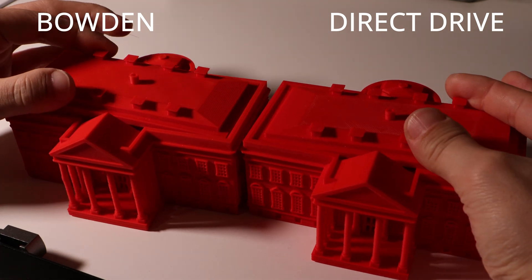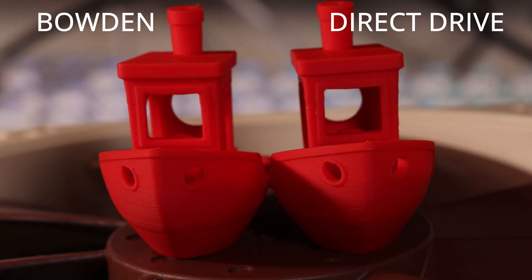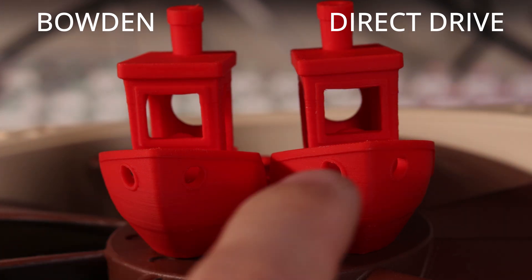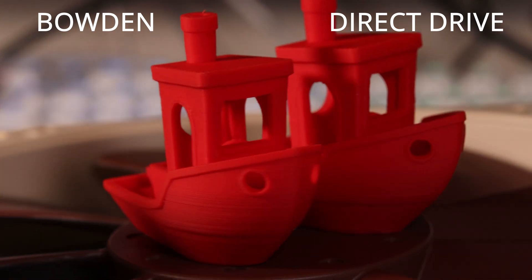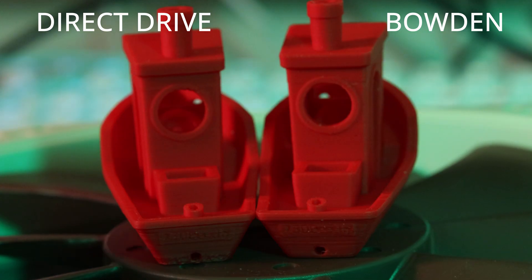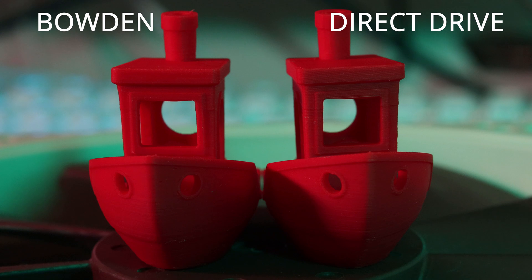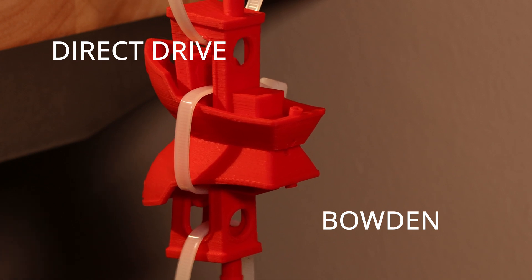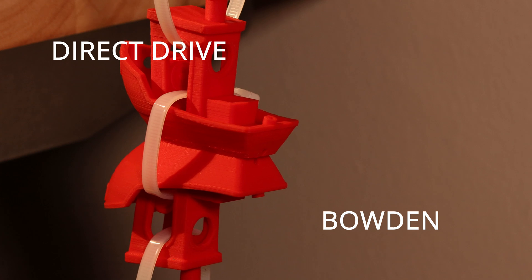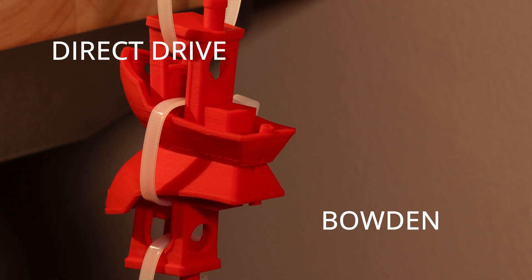When we look inside the White House models, that's where things get interesting. Here are the Benchys side-by-side — on the left we have the stock Bowden setup and on the right the Micro Swiss direct drive setup. The Benchys are switched because we're looking at them from behind. In my opinion, these both have pretty much the same visual quality, but there will be a significant difference in the strength of the two parts. I'm going to do a Benchy tensile test — hook both of them together and pull them apart to see which one is stronger. I'm laying under the test setup and pulling down until they break — make sure to wear safety glasses.